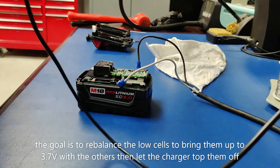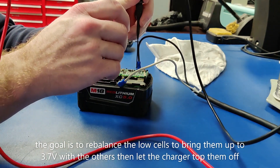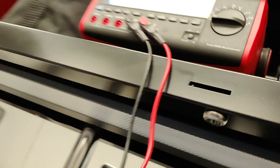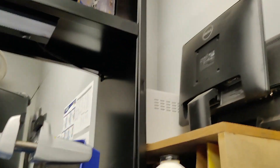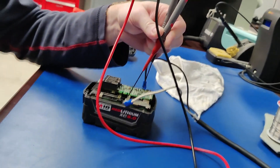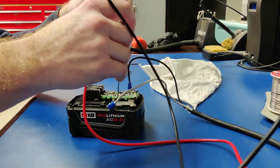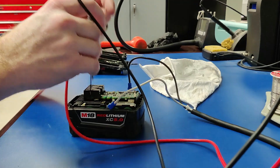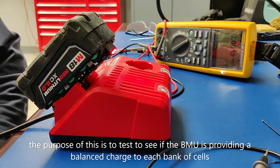This one satisfied on the drain so I put it back on the charger. It's at 3.5 and climbing as it slowly charges back up. I'm giving it 3 amps. The rest of them are at 3.7 — 3.7, 3.7, 3.7. This one satisfied up to about 3.7 as well.